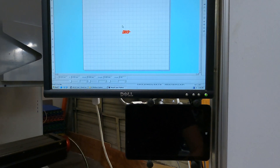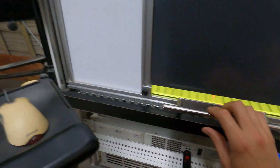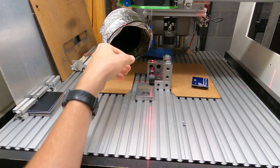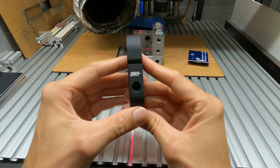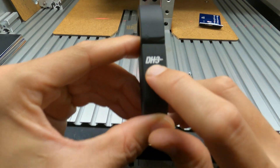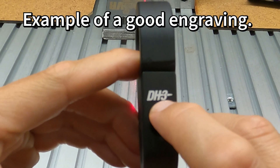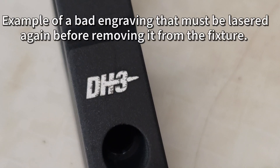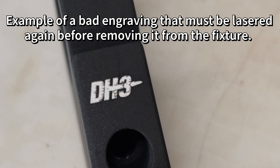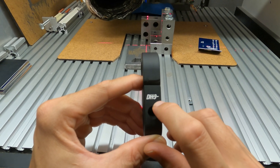Restarting the engraving. There we go — that's what the engraving should look like. You should always check the engraving first before you remove it to see if there are any marks showing it hasn't been engraved all the way through the anodizing. Sometimes the anodizing is a little bit thicker and you'll get these black marks, these remnants, and you need to engrave a few more times.